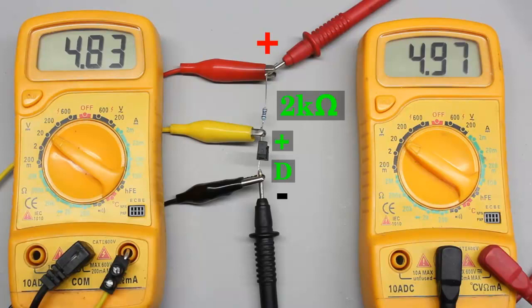The sensitivity of the phototransistor is limited to certain wavelengths. The sensitivity of the phototransistor used here is highest at infrared light. The neon tubes in the video studio emit only a low fraction of infrared light, which is why the sensor doesn't detect that environmental light.